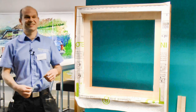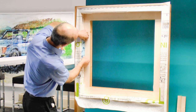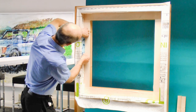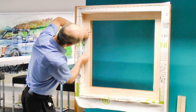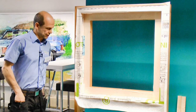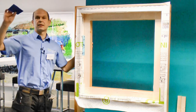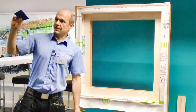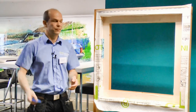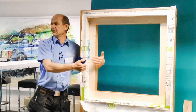With the split section, I can freely manoeuvre, bring it into position, stick it on, and I have a guide of 12 and a half mil. I know this will be covered by the plasterboard at a later stage, and I know Proclima will be happy because it's 12 and a half mil onto the window. The most important tool after the knife is your blue press fix. Any tape you install, give it a good squeeze, a good rub, and make sure you get right into the corners — sharp into the corners, don't leave it roundish.